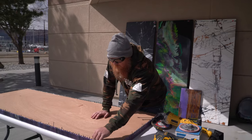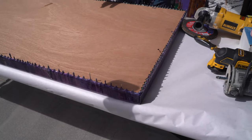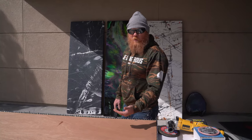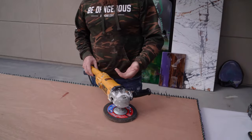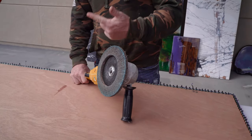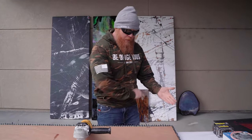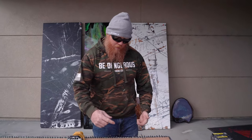This piece was poured about five times and let drip every time, so the drips are much more excessive than you'd ever deal with on an actual job. This one is upside down — you obviously can't flip a countertop in a kitchen. This is a variable speed buffer with a flapper wheel. The flapper wheel keeps the discs cooler and prevents gumming up. This rotates clockwise, so it's good to turn it at a slight angle to push the drips towards the countertop edge — going the opposite way has a tendency to create flaking or peeling.